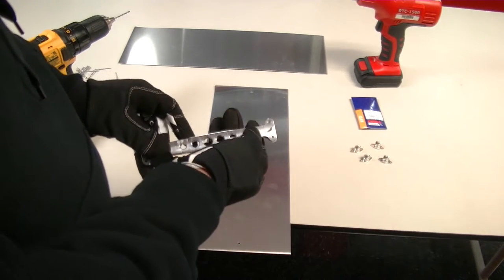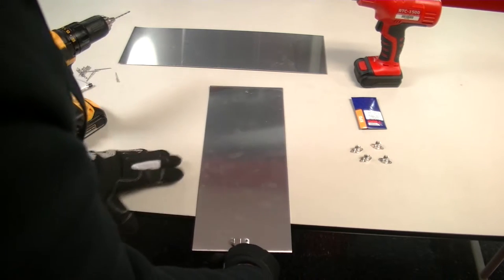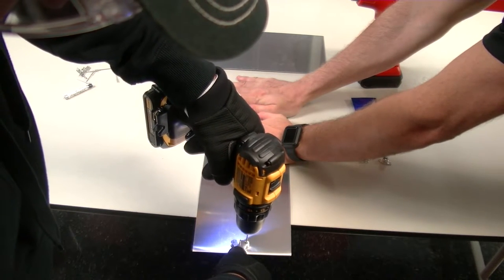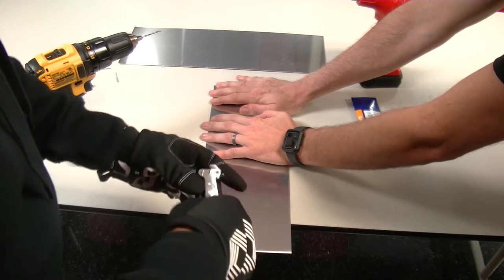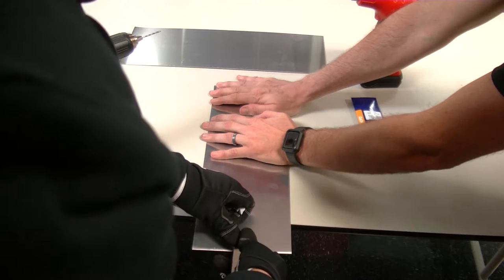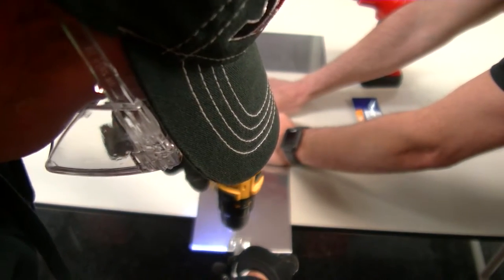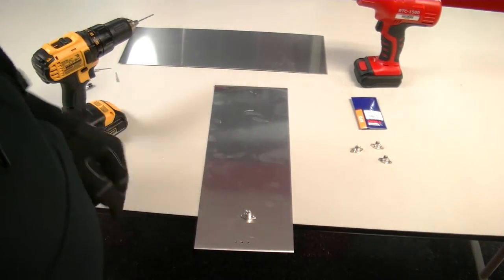Then you grab the jig, which has a center hole by itself. You stick that in the hole and it clicks in there, and then there's an open hole there which allows you to drill another hole. Once you get through there, you flip it over — the other two have prongs — so you flip it over, line up these two holes, it clicks in like that, then you drill your last hole. Pull it out and you've got your three holes that hold your quarter-turn receptacle.